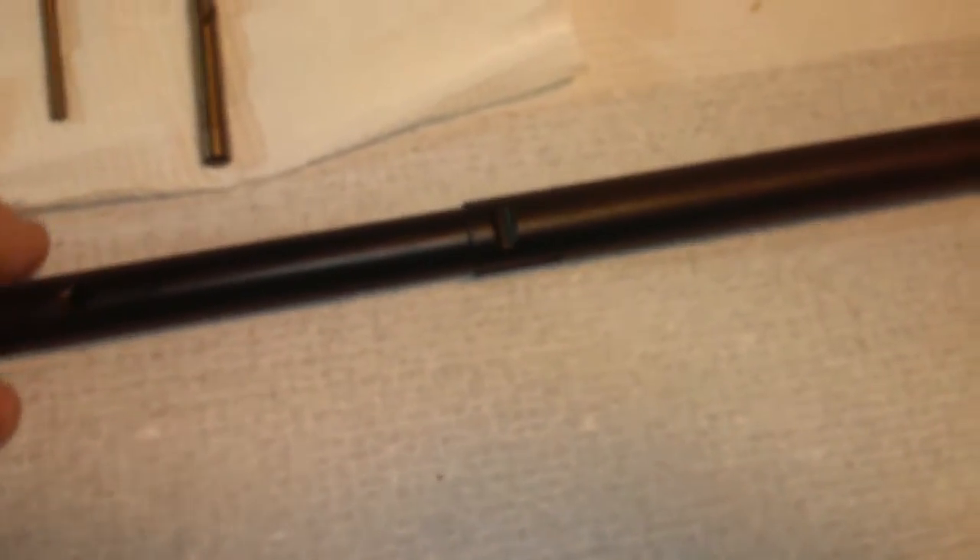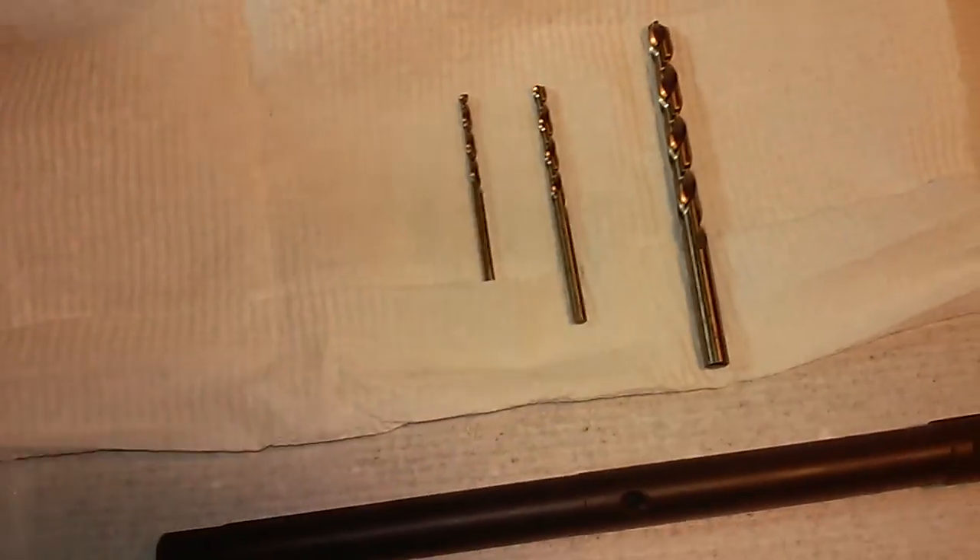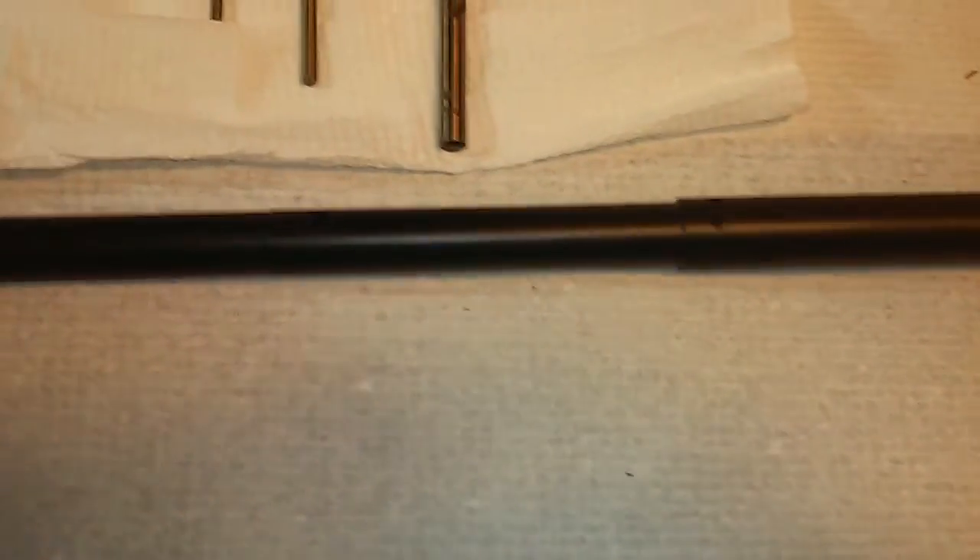That's a quick rundown on some of the parts I got. I'm still waiting on headspacing gauges and a few other things. I'm probably going to get my receiver bent and then get the front trunnion holes drilled — these flats don't have those drilled, which I prefer, because sometimes those holes might not line up exactly. I'll keep you updated as this project goes on.